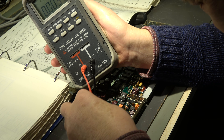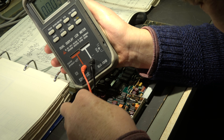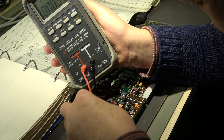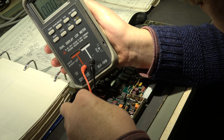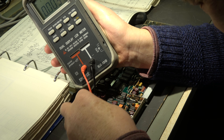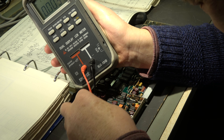I will take it out, check it outside, and I think I will replace it. Yes — it has 330 measured at 120 Hz, quality is 5. Not so good — at 1 kHz it has only 140 microfarad, quality is less than 1. Just to compare with a new one: quality is 19 at 120 Hz, and at 1 kHz 370, quality still 3. So this new one is better — the old one has to go. At least one capacitor found! The new cap is in — by the way, it's a 40 volt version; the old one had only 16 volt. 470 microfarad. That's it for the demodulator.